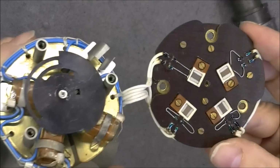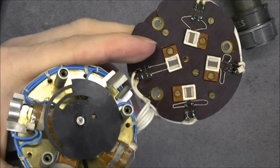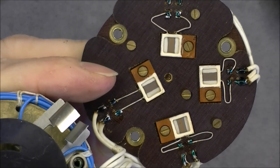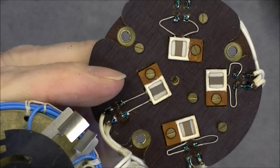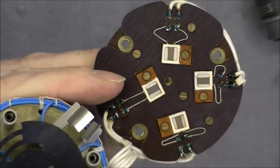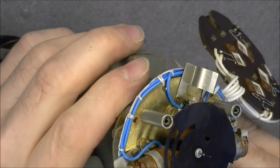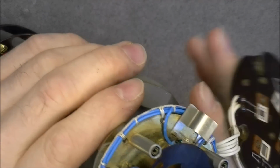And on this front piece we have what seems to be 4 photo cells. Probably they must not be photodiodes, just photo cells sensing the light. In a little bakelite holder with a little piece of glass, epoxide in front of a sensitive element, it seems. So really interesting. It is almost sad I did sell the other instrument like this, because I did not expect it to be so complicated.